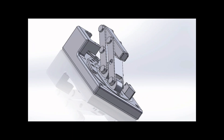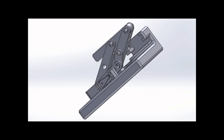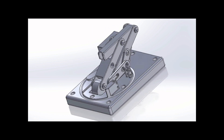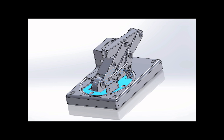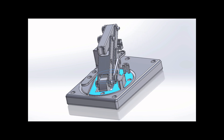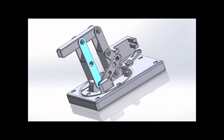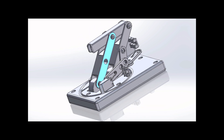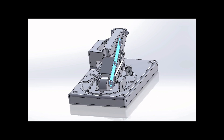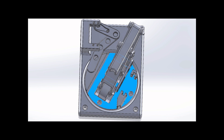Here is my final version of my assembly. I've made some minor changes to the way the base plate rotates around. I have also updated the actuating arm that pushes the arms up so it can hit the switches. In total the base can rotate about 60 degrees and the arm length has been modified so that it can support a variety of box shapes that people may create through the Instructable.